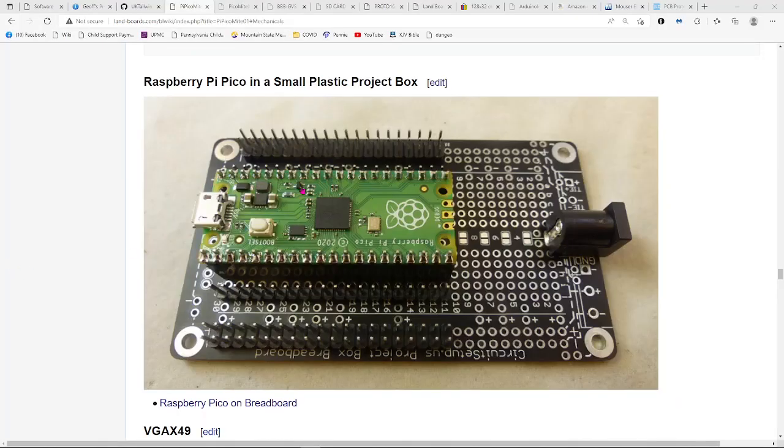First thing to take a look at is the Pico itself. I mounted it on one of these little circuit setup cards. Now I'm having a hard time finding again the one that I bought, which is the one with this little DC power jack, but there are other options out there. So I put the Pico in a socket, a female socket, or a set of 2-pin headers, and then I mounted male pins on both sides so I can get to any of the pins that I want, and then I mounted power and ground strips down the side. So this turns the ability to easily pick off power and ground and then pick off any Pico signal, and it mounts it in something that's fairly solid, and I can easily cable up to it.